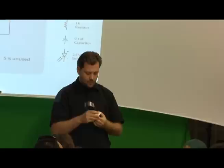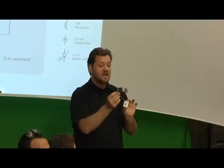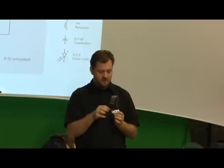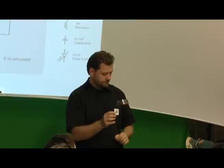And now if you want to take power from that, typically on all of the devices that I've built like this, the colored side is going to be positive, and the white or black side is going to be negative. Just something to keep in mind. All right, so if we want to take that power and run it down to our IC, you would do something like that. So you basically just connect it to the same little row that your power comes in, and then you bring it down. Okay? So that's how these work. We've got a lot more to talk about, but that's just the essential parts of these breadboards.